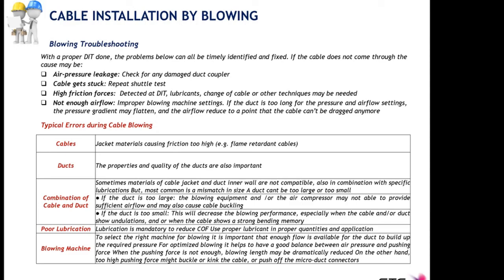This is typically the case for indoor cables like plenum cables or low smoke zero halogen cables. Poor quality cables may also cause difficulty in installation. However, all cables at STC are pre-approved, so this should not be the case in the field. The cable may also have a strong bending memory or be very rigid and stiff, potentially impacting installation. This is STC's responsibility — cables must be suited for purpose.